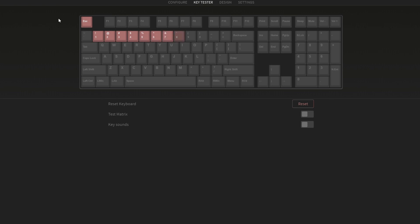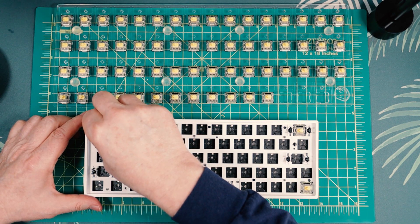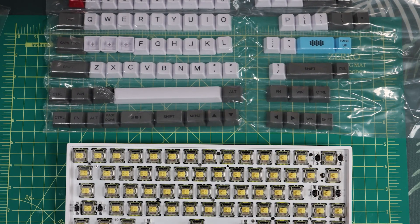As always, before building any keyboard, it is a great idea to test the PCB lest you start all over again. Simply head over to keyboardtester.com, use a pair of tweezers to make the contact, and make sure they all work. When you plug in the PCB, you will see that it's also very bright and even has LEDs on the bottom sides, although they won't show in this case. Normally I would install the switches with the PCB out of the board, as it allows me to support the hot swap sockets with a finger on the back, which eliminates the possibility of a bent pin pushing the socket off the board. But because of how overly tight this plate fits, I chose to install the switches after reassembly. If you do this, just make sure that your switch pins are very, very straight — it should not require force to get them in the seat. After all the switches are in, go back to keyboardtester.com and make sure they all work. If you have a bent pin, this is the time to remove and fix it. If everything works, it's time for keycaps and to enjoy something you have built yourself.